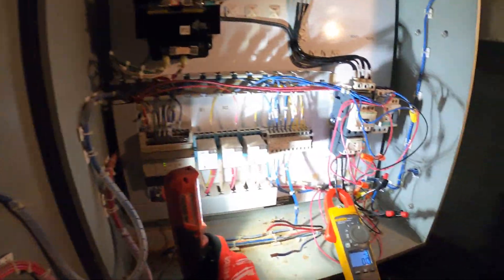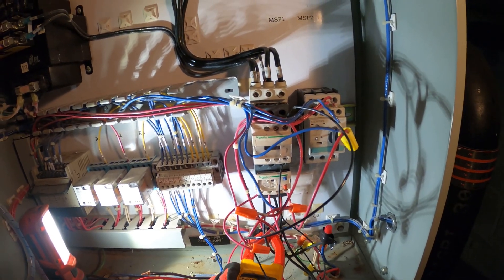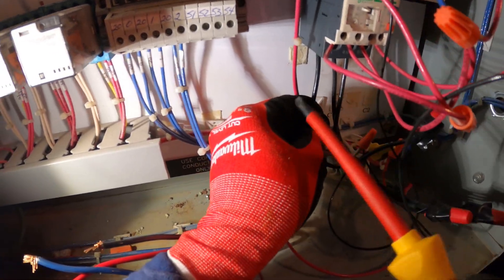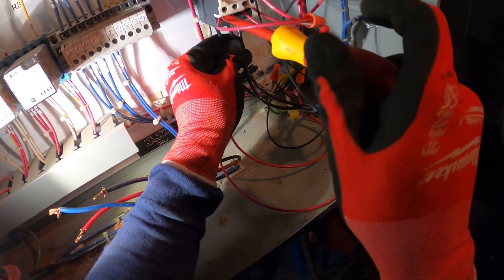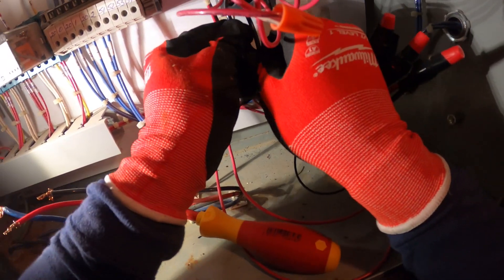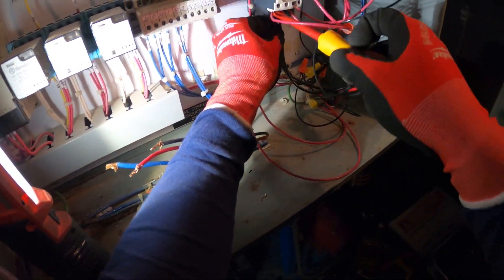Okay, it was going the wrong way. We got our three phases crossed up, and I'm going to show you how to fix that. Let's turn this off. The way to do that is to reverse any two wire leads. This wire we're going to put in the middle, and the middle wire we're going to put on the opposite side. So we're going to swap: put the middle wire to the left terminal, and the left terminal wire to the middle. Just take this out, put this one in here, and this one in there — and like that we're going to reverse the direction of that motor to follow the correct direction.